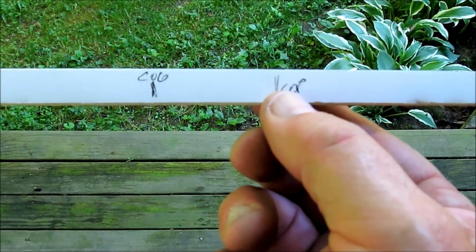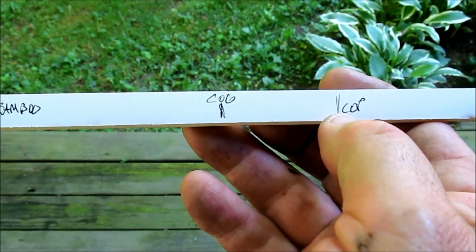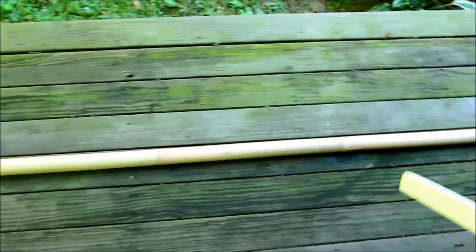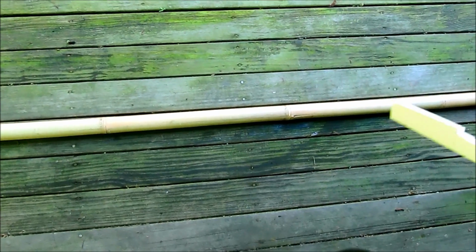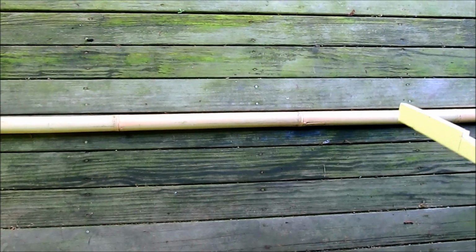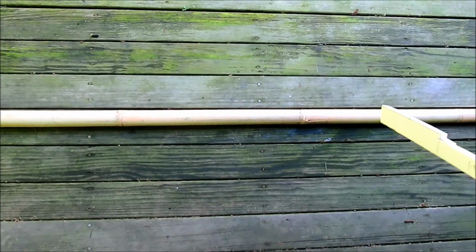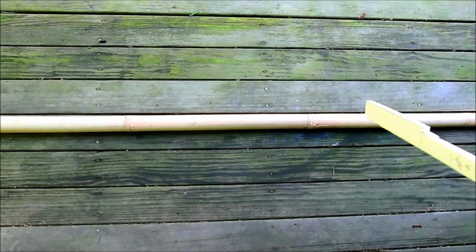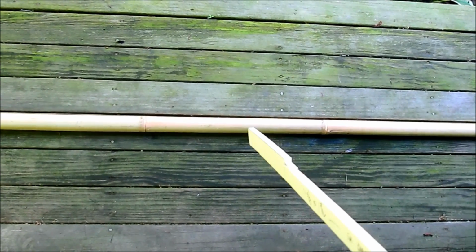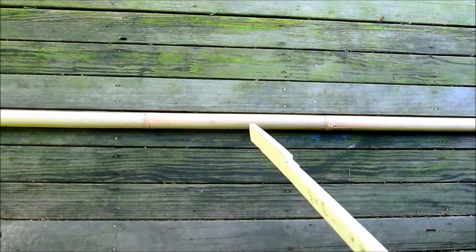The bottom line is, on this scale, the center of pressure is behind the center of gravity by 1.5 inches, which means on the real model, the center of pressure is going to be behind the center of gravity by 4.5 inches. That means this will still fall motor down, on some sort of an angle, until it hits the ground. So my goal is to move the center of pressure forward until it meets the center of gravity and they're at the same place. That will result in this model falling flat to the ground, ideally, hopefully.